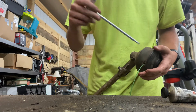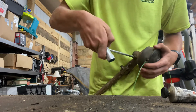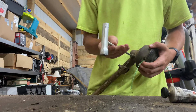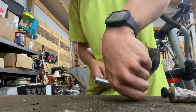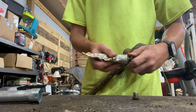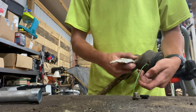You want to take the STIHL tool that comes with it and remove this bolt right here — just take it off. They can usually be a lot harder to take off than that. Don't drop it or get any dirt on it. Then take the grease tube and it actually threads right into the head of the weed eater.